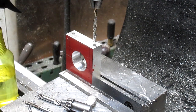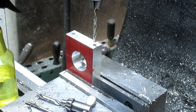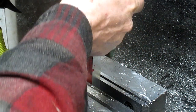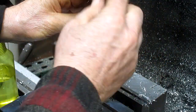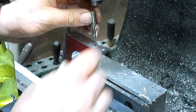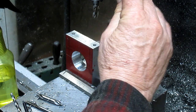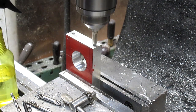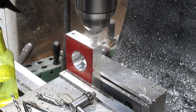We're gonna have to readjust that anyhow, so I'm thinking maybe we go down and put our countersink in so that the bolt head gets down underneath our countersink right there. Let's hope that's gonna be, yeah, it'll be fine. Now we are going straight down, so we're using this as a drill bit rather than a mill. So we can put it in the chuck and everybody's still gonna be happy.